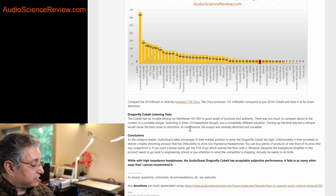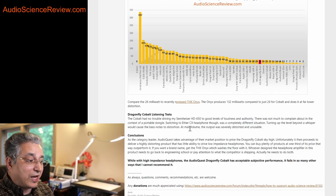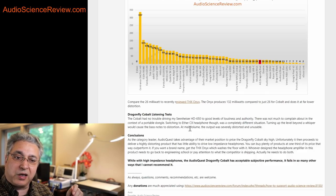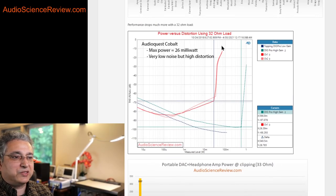The second test headphone is the Ether CX from Drop — only 25-ohm impedance. At very low volume it sounded fine, but the moment I got to medium volume it was already distorted. By the time I got it to max volume, it was severely distorted — not a subtle thing, not just a little bit bright. It was just completely gone, basically operating in the clipping region where distortion goes through the roof, almost as strong as the signal itself. I clearly needed more power than 26 milliwatts to drive the Ether CX, and that's unfortunate.